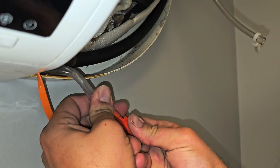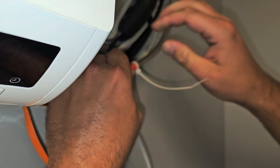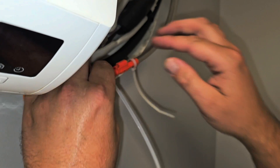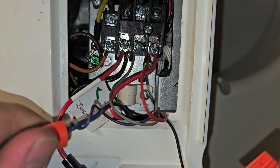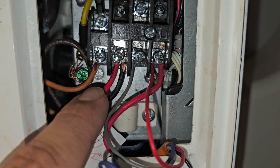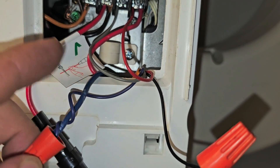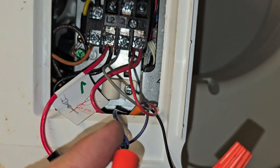Now I'm installing the new anti-siphoning device so that we don't have any issues. Now I'll route the cable up into the ceiling. New power for the new pump is wired in — briefly going over that: black wire goes through the 1-amp fuse into one side of the power provided to the pump, red wire goes to the other. So red and black to L1 and L2. Then the signal wire goes through the normally closed switch via the purple wire and comes back, with the gray connecting to the terminal for the indoor unit, breaking the communication from the outdoor to the indoor unit if needed.